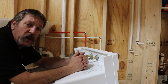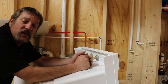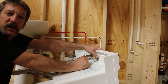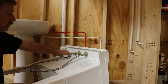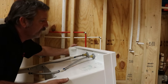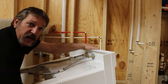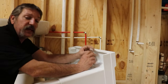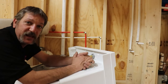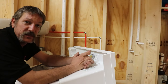Now that I've got my rough-in where I want it, it's time to install this thing. Pick up whatever laundry tub you want — most of the time you have to assemble the legs with a couple bolts and screws; it's not that bad. When trimming this thing out, sometimes the laundry tub will already be drilled out back here. You can see there are several guide holes for whatever type of faucet or device you want. The first thing I recommend is laying this thing down. If you're on a concrete floor, there's a risk you might scratch the face of the tub. Set something on the ground — find a scrap piece of carpet or something — and protect that finish.